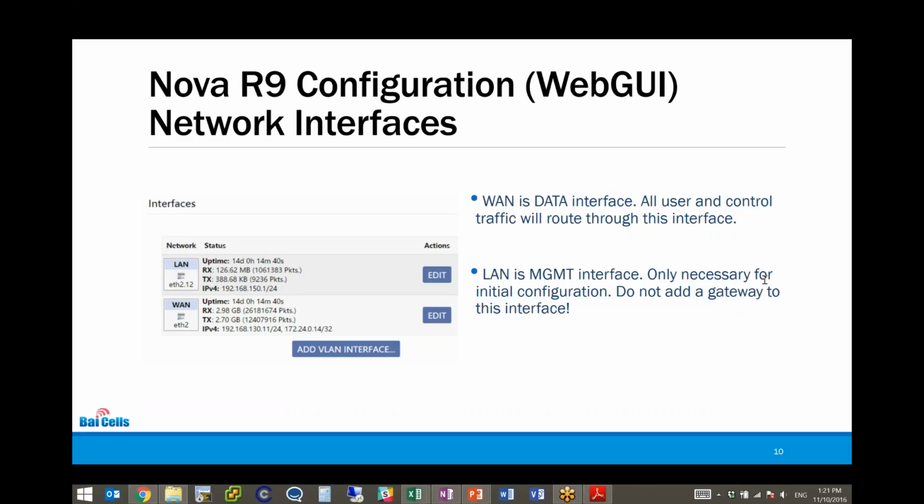Is there a plan to increase eNodeB capacity with a release update, or do we have to swap the eNodeB? I don't know if they're talking about subscriber capacity or throughput, but on the subscriber end, the 96 will be the most ever. And the throughput is what it is for release 9. I don't think there's going to be any updates to upgrade it past release 9.